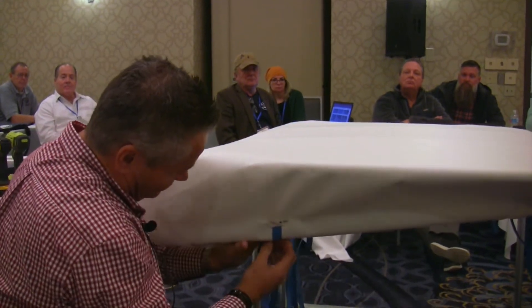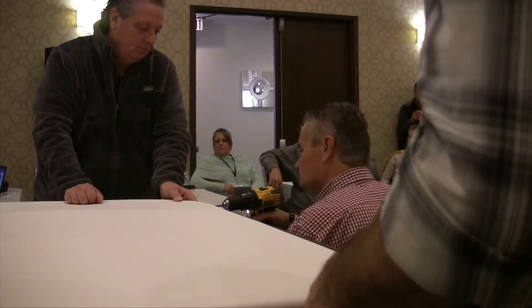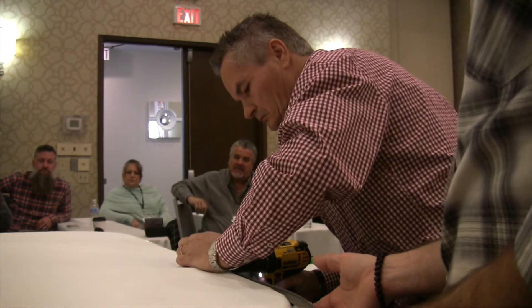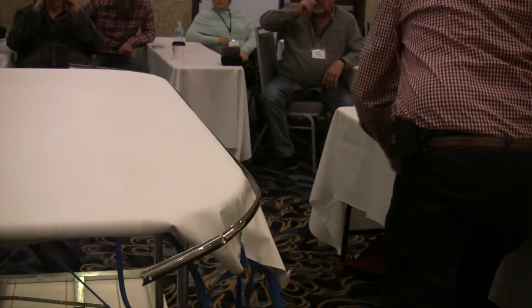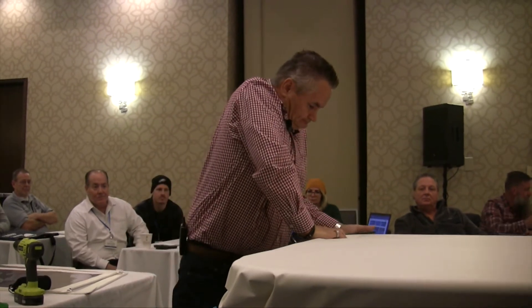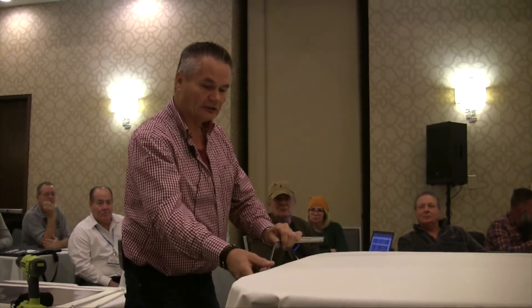Watch this thing — it's just as you want it to look when it's finished. Now I'm pulling on the straight edges and then I'm going to get into the curves. Once you've got one screw in place, everything winds up right. Now I'm going to need to find the first hole. How do you bend the band? You get it on a straight edge, start on a straight edge, drill and put one, two, maybe three screws in to hold it — and then this thing just walks right around the corner. This is stainless. By screwing it tight here, it gives you a little bit of leverage to pull around.